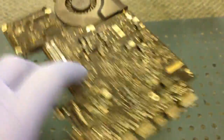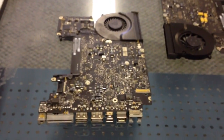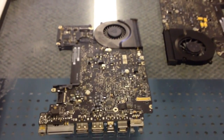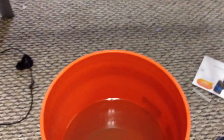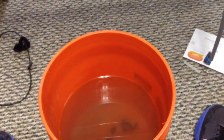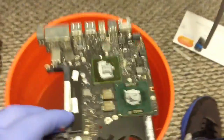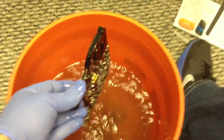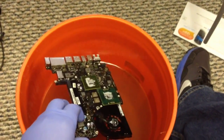You can tell the board is corroded here, over here, up here, and in this area. What we're going to do is take them apart and put them in some cleaner. We've removed the heat sinks and speakers, and now we're putting the boards through our pre-wash — it's going to chemically break down what's on the boards. We'll take a brush, submerge each board, and scrub them clean.